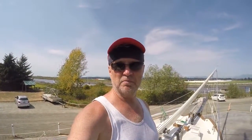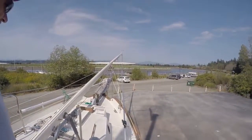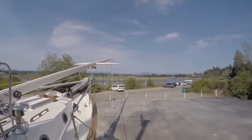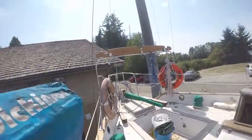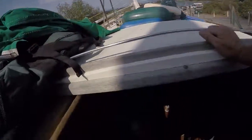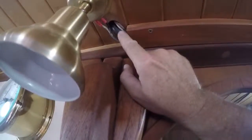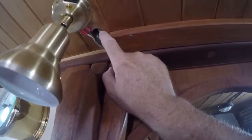We seem to have come to an impasse. The mast is down and I've tidied up a lot of the running rigging and organized the standing rigging so it's not just hanging off all over the place, although it does look a bit of a mess down there. There's bound to be something inside, so I took myself inside and this is what I found. This is where the cabling for the mast comes down — that heavy one is the antenna, RG-8 or 9 I guess, and the lighter stuff is for the lights, the masthead light and so on.